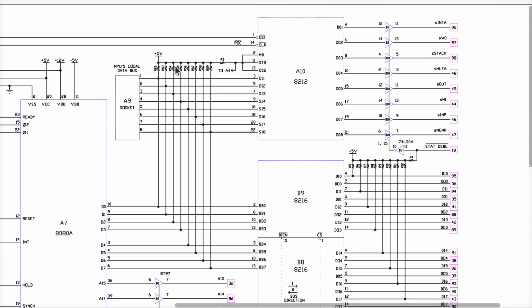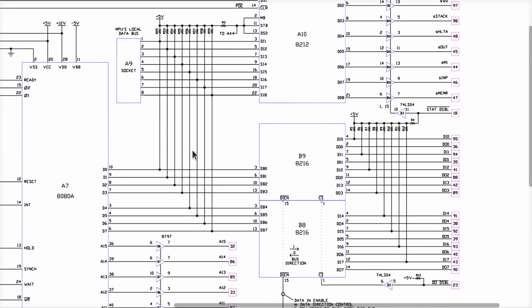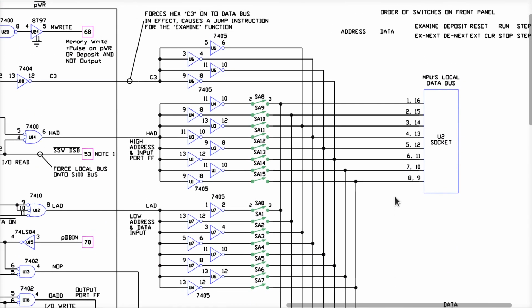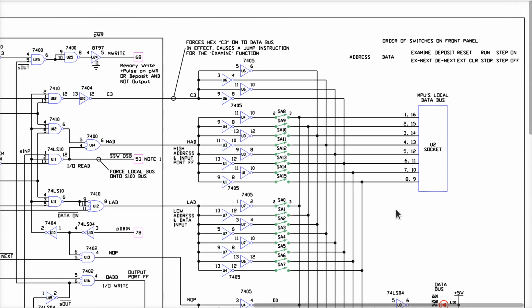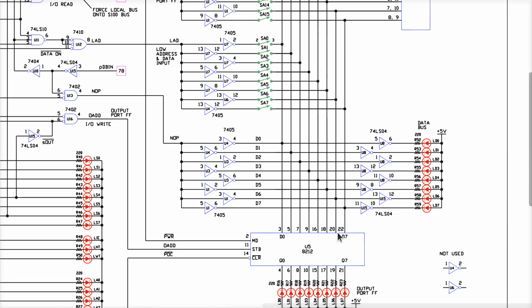It could be simple. Bad soldering. No pull up. Guess what? They'll never go high. Nothing else is pulling up on these lines. Wouldn't that be nice? Spoiler alert, it's not going to be that nice, but we'll look into that. The only other thing it is, in my opinion, if it's not one of those pull-up resistors not pulling up, is one of the gates that's on this bus that will not let it go.